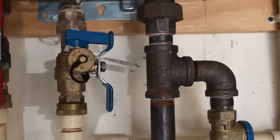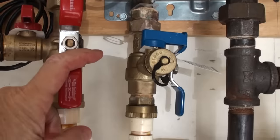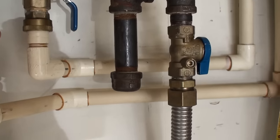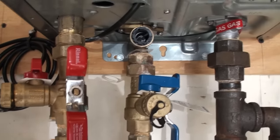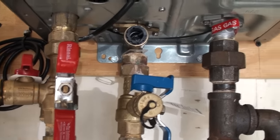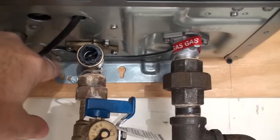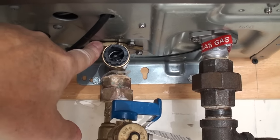With both switches off, turn the hot water on so there's no water in it and it's empty. Then turn the cold water on really fast, and sometimes that will help and it will start back up again. What happens is there's a spinner right above here that's supposed to turn, and if it doesn't turn, your water heater won't come on — but there's no error message.